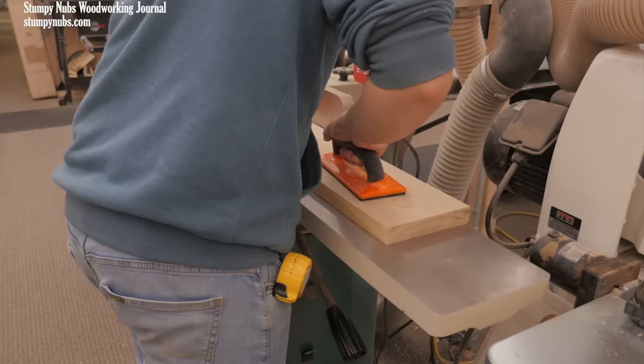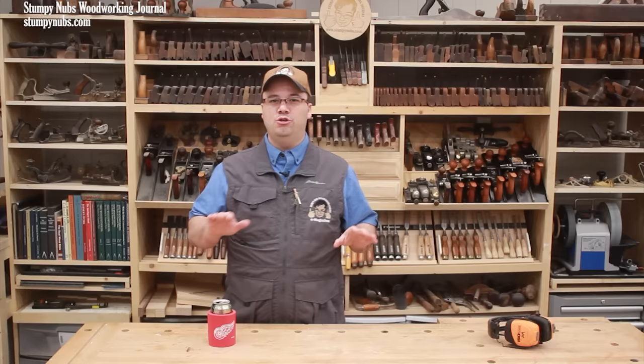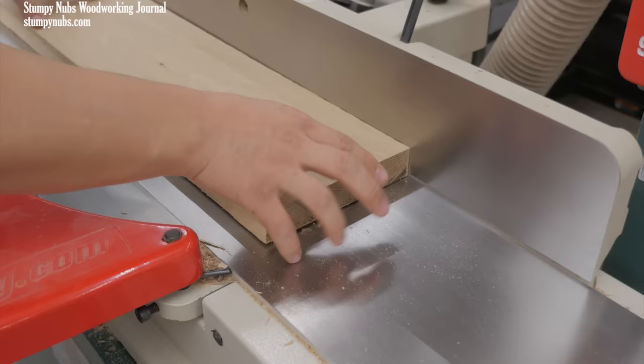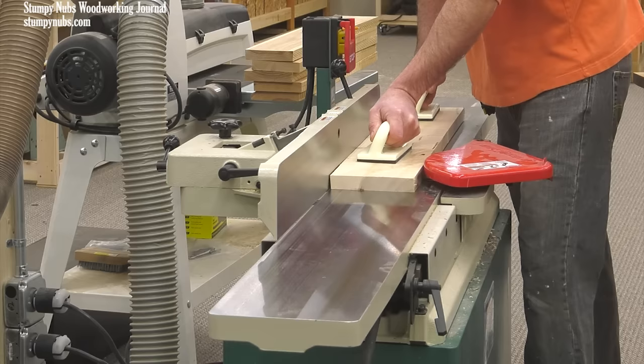Note how paddles are used to feed the wood over the cutter head. I insist that paddles be used in my shop for a couple of reasons. First, you cannot trust that the wood between your hands and the cutter will stay there — boards can split and break, and the cutter can catch and kick wood from your hands. You don't want to be applying downward pressure over the cutter with your bare hands if something happens to that wood. Second, you may be tempted to hook your fingers or the heel of your hand on the end of the board, especially if the table is a bit sticky from resin. Use two paddles, one in each hand, to ensure you never put your hands in the wrong place and you always have something between your hands and the cutter if something goes wrong.